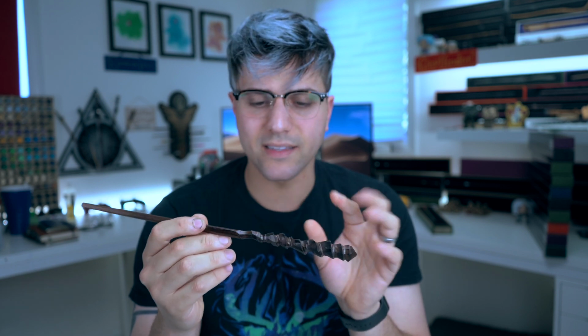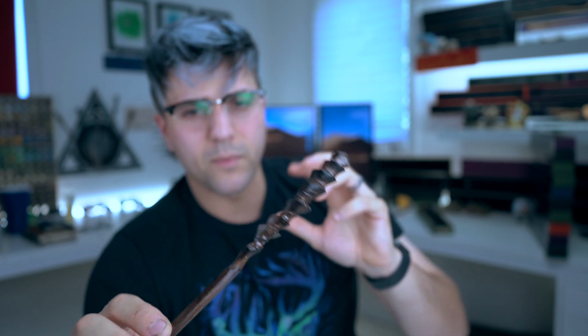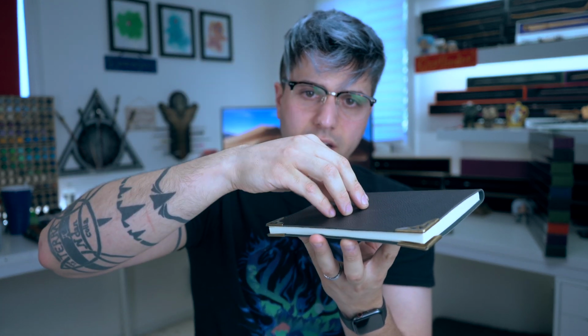I also did a little bit of burning on it just to make these ends here a little bit darker right around the edges. Remember, I think I've said this several times, if you're using a torch or any sort of heat on it, the thinner the wood is, the sooner it's going to burn. So if you have a big flat piece of wood, it's going to absorb the heat a little bit more than the edge. So let's say this is a piece of wood and you start burning it here, and then you get to the edge with the fire.